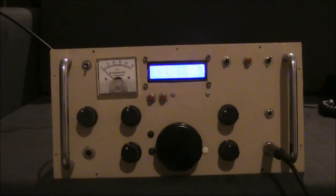There's no AGC or other refinements yet. I started building this about three or four years ago and made rapid progress. However, it was put off to one side. The original aim was for it to be a six-band transceiver, requiring six individual bandpass filters covering bands between 160 and 20 metres. However, it seemed to be a bit deaf on 40 metres — obviously a problem with the bandpass filter — and I never got around to having a look at it until a few days ago.